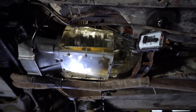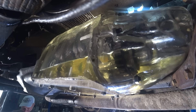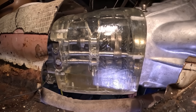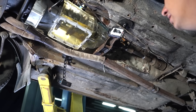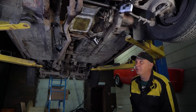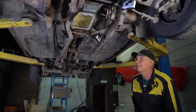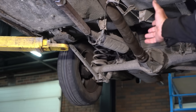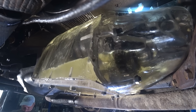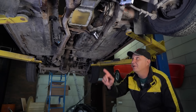Now we're about to find out whether it'll keep it together. I am super curious — we're going to find out how much stress the transmission is under while the car is moving. Start the engine! Hold your horses. I can see the prop shaft. Engine is still cold. Okay, grab a gear. The curious thing is that it works — the wheels are turning, so is everything else. Excellent. Why is the dog clutch jumping around though? So this is actually quite interesting — engine operation isn't buttery smooth, it's sort of gyrating, and as a result the dog clutch is moving around, even though the fork is holding it in place.